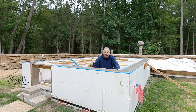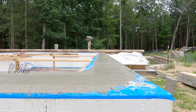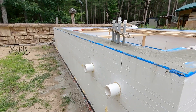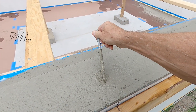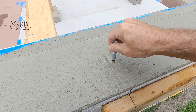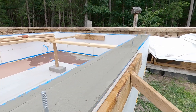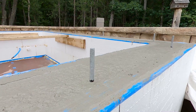I'm well pleased. Look how straight that wall is — that is straight. Notice the black Sharpie marks on the ICF showing anchor bolt locations. My project calls for typical anchor bolt spacing: anchor locations to be within 12 inches from the end of the sill plate lumber, spacing no further than 6 feet apart, depth a minimum of 7 inches, and no closer than 1-3/4 inches from the edge of concrete.